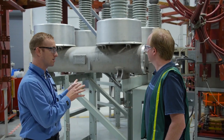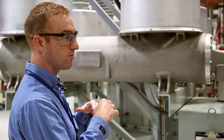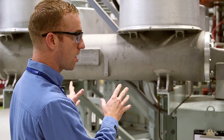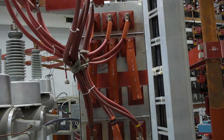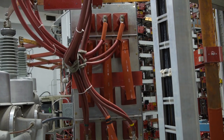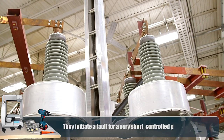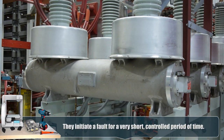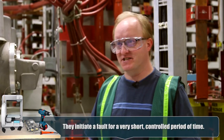This is the SF6 interrupter. It's not used very often, but when we're doing very high current calibrations we want to make sure we operate this. It's kind of backup protection for our main breaker right there — that's about a 1200-amp breaker, which does the majority of the load breaking. The closing switches can't break loads, but they can close onto faults. So you have fault protection for your testing of fault protection.